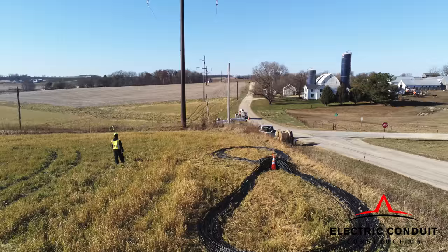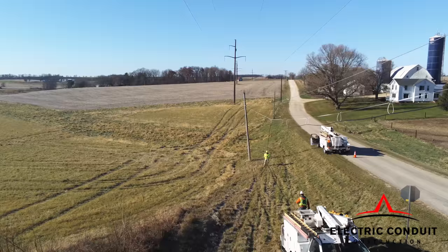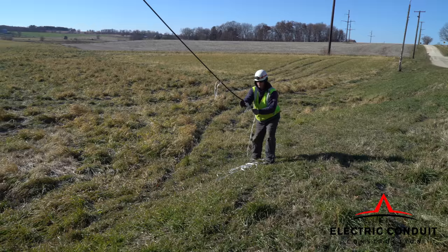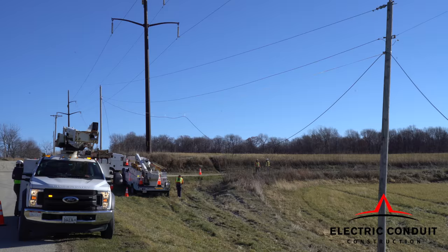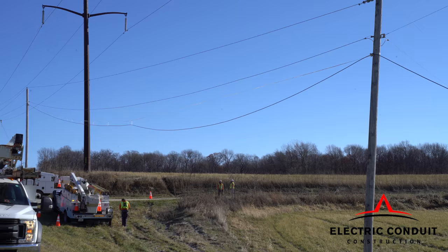There are a few things to note about each type of installation. Pre-planning and project management are critical to a successful installation. Drawings generally do not note the voltage, electrical configuration, number of transformers, secondary taps, position of the system neutral, or condition of the poles, and whether all poles are accessible by bucket truck or traditional climbing methods.